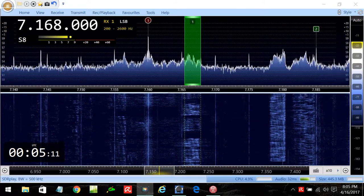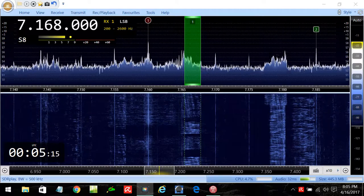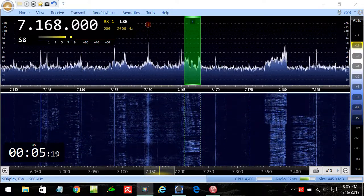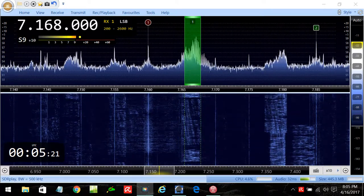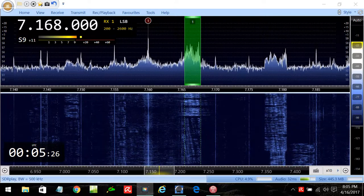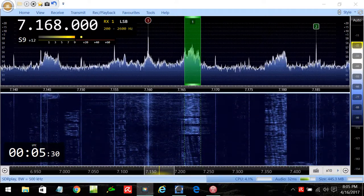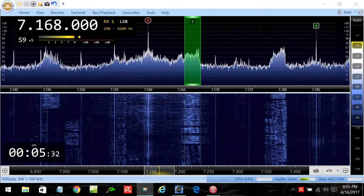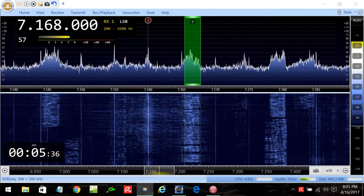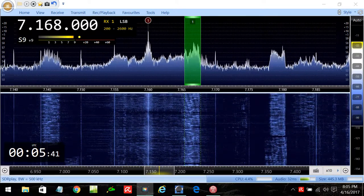A lot of people don't know that you can run 200 or 300 feet of that stuff and just put a balun at both sides. You talk about low loss if you've got to run a long distance. That's a good way to do that. Yeah, I run out of the back of the shack, and then it goes up in the air. It comes down on about a 45-degree angle toward the shack, and it's right in the center of one of the legs. And I feed it there, and like I said, the loop itself is about 1,000 foot of wire.